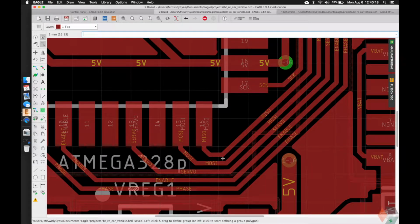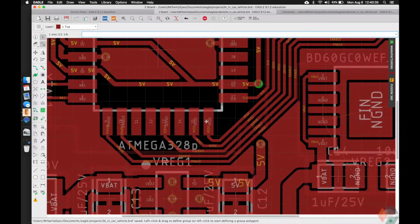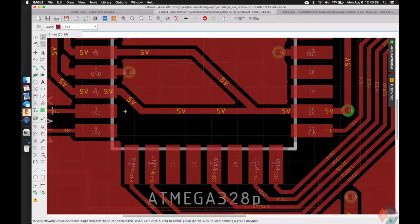Here we're not going to put a via to connect this to ground. We might do it for this one, but for this one it's not that big of a deal. Again, we'll only be saving a little bit, and we could have alternatively made another joint for all these if we really wanted to save on some of the ground here, and again make this a little bit shorter. Also here we can probably just route the 5-volt along the edge. Let's go ahead and do that.